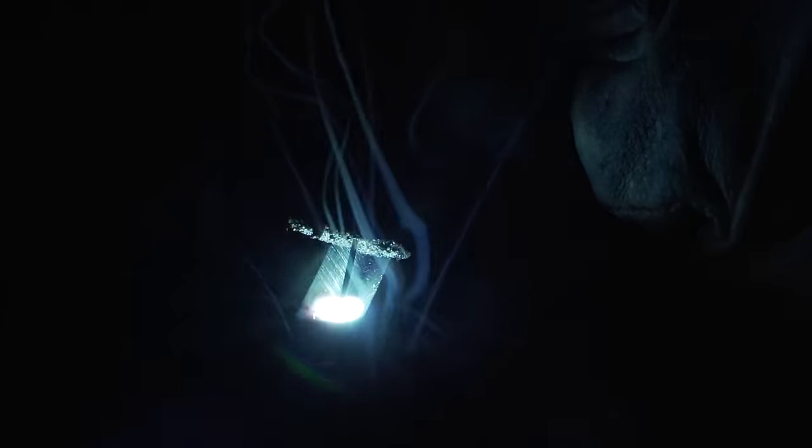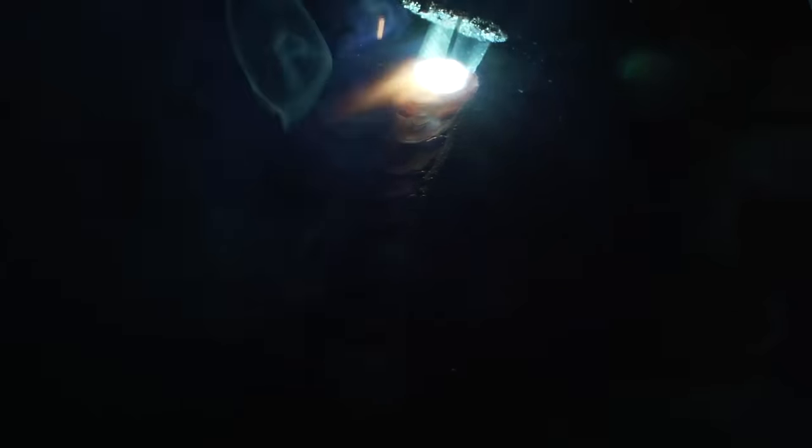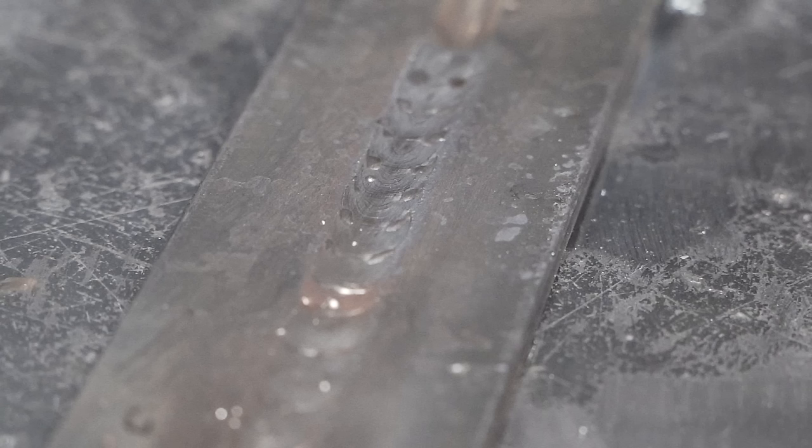On this next step, we're going to do exactly what we've been doing — except now, once we pull the trigger, we're not going to let go. We're going to fill up the valley and move to the edge of that puddle, let it fill up again, and move to the edge of that puddle. By doing that, we've significantly upped the heat in the base metal just by not allowing the short time for the weld to cool between each bead. Practice this one for a while to get your spacing and timing perfect.